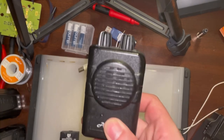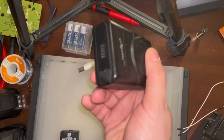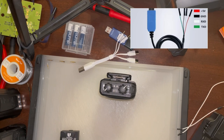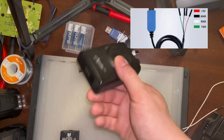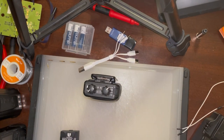Programming this is not pleasant — it takes trial and error and skill. I'm very happy I was able to do it, mainly because the programming cables or cradles that come with these are very expensive — like $200 to $300, almost the cost of the pager itself at OEM MSRP. And all they really are is a glorified PL2303 or TTL-type cable. You can get a TTL cable for about $15 off Amazon and do it yourself. It's not that difficult, it just takes patience.